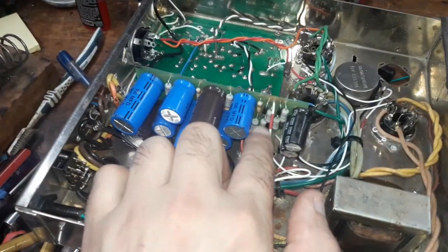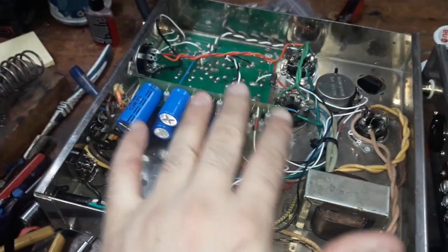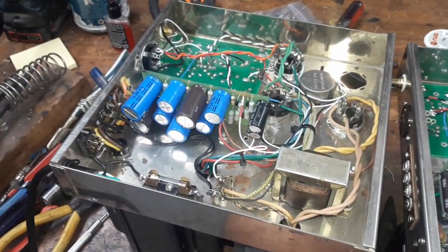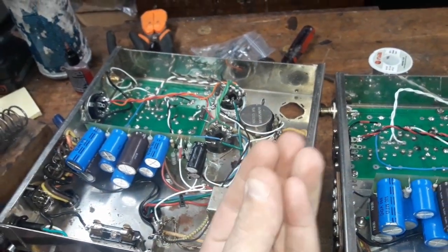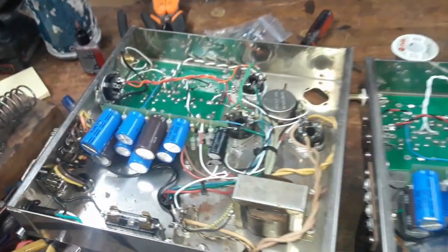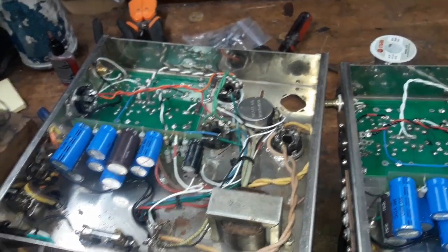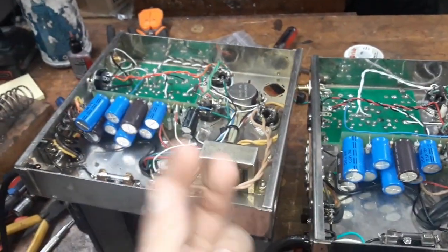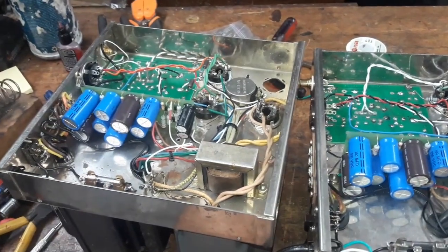And this board, if you see these 4 black little dots there, those are the diodes. This is actually meant to have a solid state diode rectification, but I bypass this on the board and I'm going to use a plug-in module. Basically, by skipping this here, I've left the option on the tube rectifier. So besides these little diodes here, I'm going to make, from an old tube socket, a plug-in solid state rectifier.